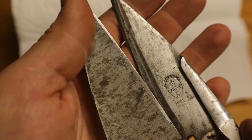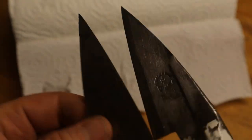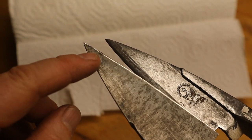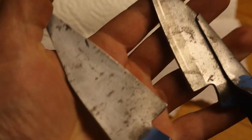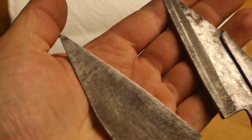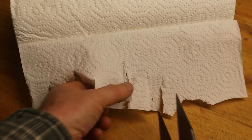You can see that line — the back's been worked. Somebody took something to the back of this blade and put a bevel on it, so the apex doesn't touch when you close them. This is a big no-no on scissors or any tool like this — you can't do that. The only way to fix these is to grind all of that back. Here's a pair that has not been worked on the back — those have not been touched on the back side, and they cut nice and clean. I should have caught this earlier.